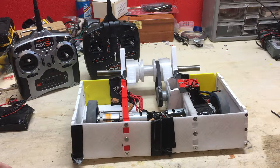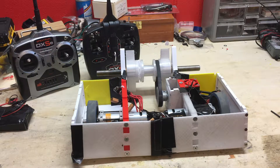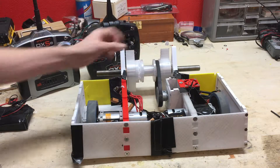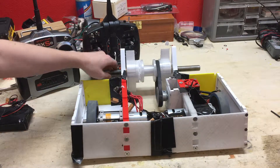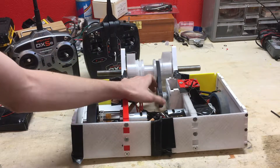It's pretty cheap, but not the cheapest. There are some design changes that are not in this actual prototype. The weapon is on here — it's 1 inch, but we got 7/8-inch stock so we're just gonna cut that out on the water jet, cut it in half, and that will give us our weapon. We originally were going to make our own pulleys, but we decided to just get some pulleys and separate them with steel tubing that will run through the whole weapon system, and everything will be welded together. This is a dead axle so the shaft doesn't move at all, and the pulley needs some work as well.